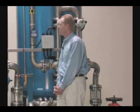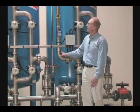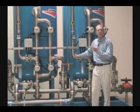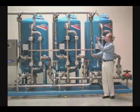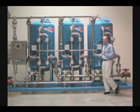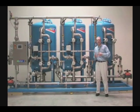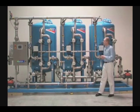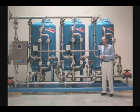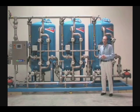Most of these situations involve removing either one or multiple different types of contaminants. You can see that in this particular application there are three vessels in a filter-system configuration. The flow is basically split between these three vessels, and the sizing is proportional to the site. This unit is set for somewhere around 200 gallons per minute for a typical contaminant like iron and manganese removal.